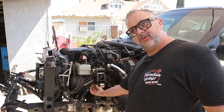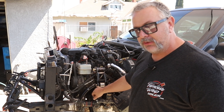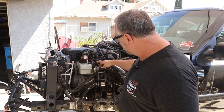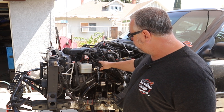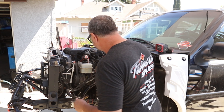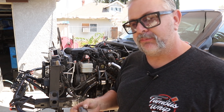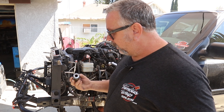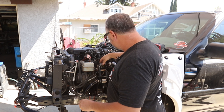The plates I drew — I always go ahead and try to engage the bolts, so that even if anything starts to show fatigue, it's still captured by those bolts. To me, that's an important load value. Then I made a boss: I'm going to do a tube crossover, keep it simple. To make that boss, I took a pretty heavy-walled tube and welded an inch-and-a-half tube over the outside of a heavy wall — about a 0.250 wall with a 5/8" ID, slightly under. I actually had to machine it on the lathe just a little bit and drill them out. That's a 5/8" bolt that slip-fits right in there, and then I can land an inch-and-a-half tube all the way across.